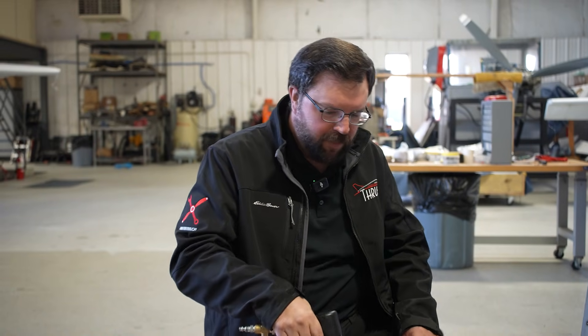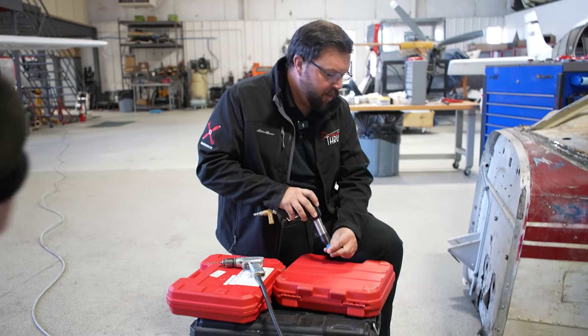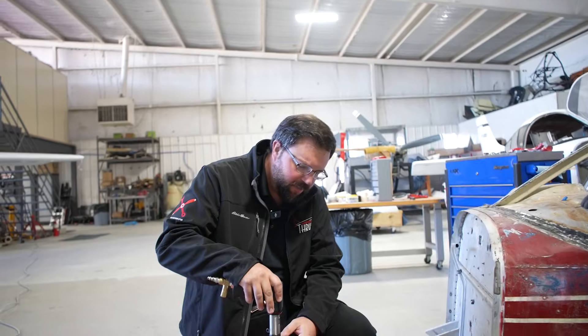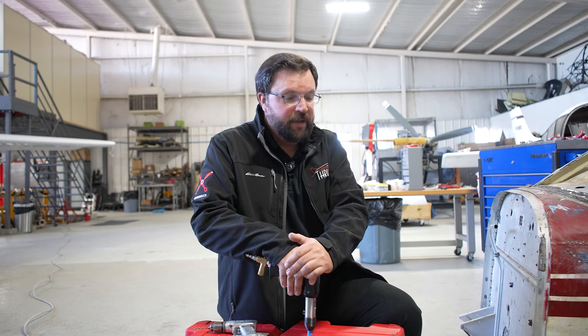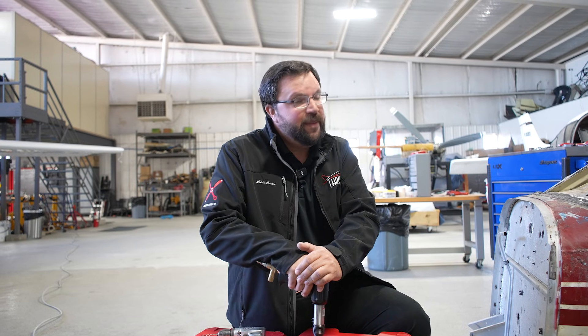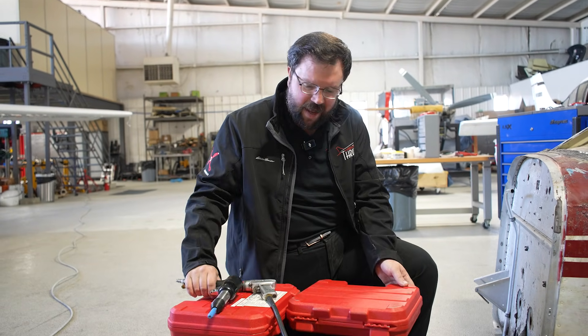So if you want to hit it harder, you pull harder. You want to hit it less, you let off a little bit. When you're using these, a couple of important rules. One is get it right center down the rivet and press down firmly into the rivet. Pull the trigger and that will activate the flow. Now if you want to limit the amount of air or the amount of power in here, you're going to go ahead and change the dial.